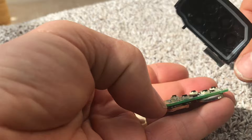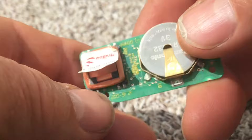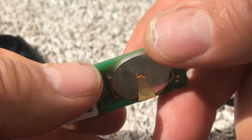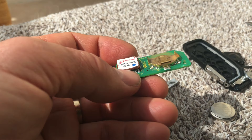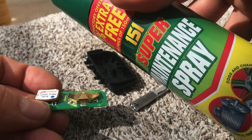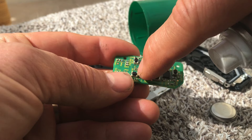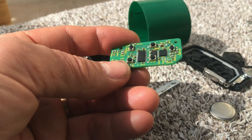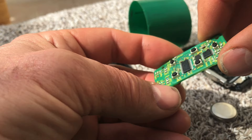Just to show you how much electronics is on there — there are quite a few chips, a transistor or something, and then you've got this coiled unit. What I did first was take out the battery — that just slides out. Everything needs cleaning up and any water needs dispersing. What seems to work reasonably well is a can of WD-40 or similar oil maintenance spray. Squirt it liberally and forcefully all over both sides of the board, in particular around the legs of the integrated circuits, and try to get it underneath because that's where water gets trapped. I then used a little paintbrush and gently brushed all over the circuit board to try and dispel any bits of electrolytic oxide that had built up.